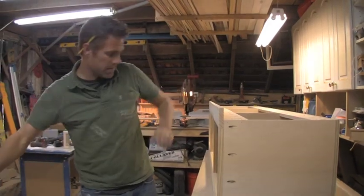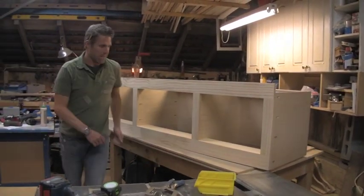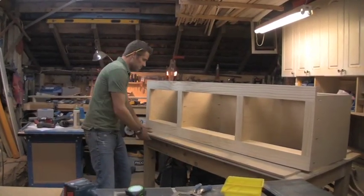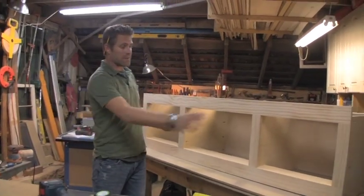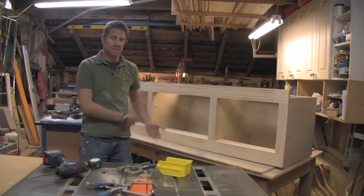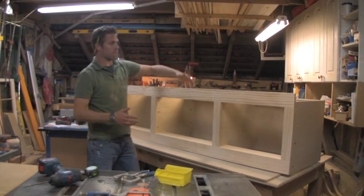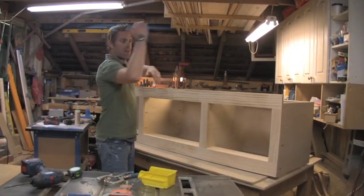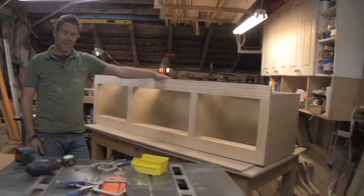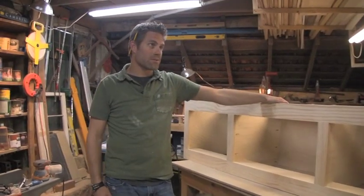There's your box — check it from this side. You're starting to see it come to life. This is the space that otherwise would have been wasted — where you'd throw shoes and stuff underneath. Now we'll build drawers that fit in here, here, and here. Remember, there are two of these units, one on either side, with a footboard at one end and a headboard at the other. You've got yourself a built-in bed with storage.